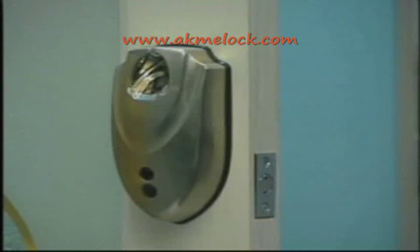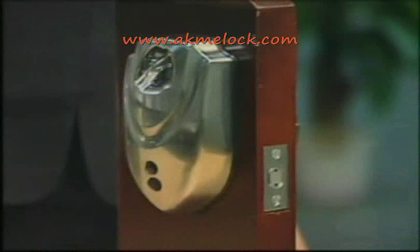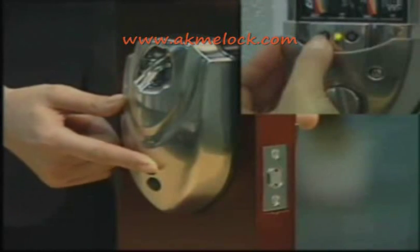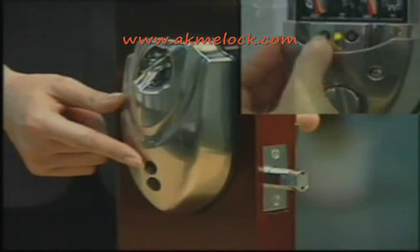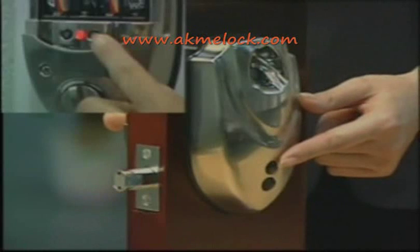After installation, sometimes you need to program the unit to work on right or left hand doors. If you open the door with your left hand, it is a left hand door; with your right hand, it is a right hand door. The default setting is suitable for a right hand door. To change to a left hand door, make sure there is no fingerprint on the lock and the knob is in the unlocked position. Press and hold the save button and with the other hand press the power on button. If the deadbolt protrudes outward, you have programmed the unit successfully. To change back to a right hand door, ensure there is no fingerprint on the lock and the knob is in the unlocked position. Press and hold the delete button and with the other hand press the power on button. If the deadbolt protrudes outward, the unit has been programmed successfully.